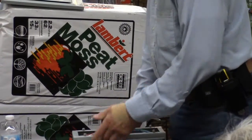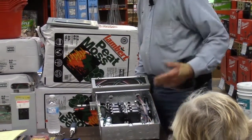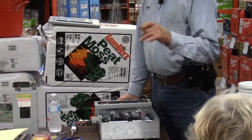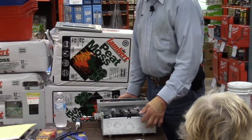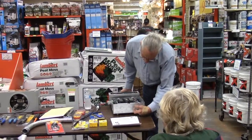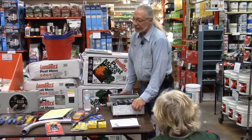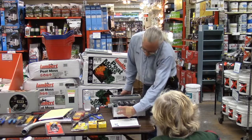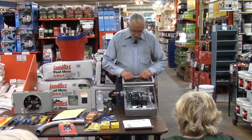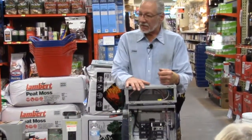The reason I say map it is simply because these cutouts that you see in here and here will not match what you've got now. I can guarantee that. If they're close, pipes can move a little bit to snap into a new hole. But if it's half a hole or more off, it's extremely hard to cut into solid metal, and usually you end up ripping the insert out if you're cutting across holes like that. That's why we end up with what is a lot of times known as a wiring trough. This is not part of the panel. This is an add-on.